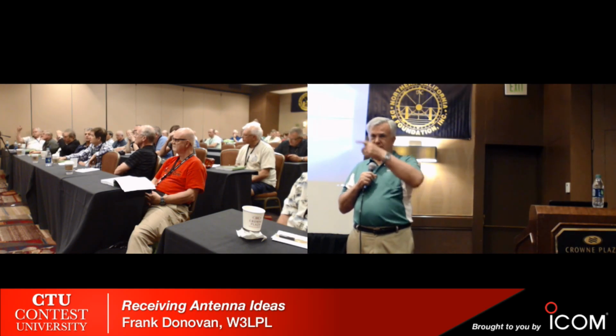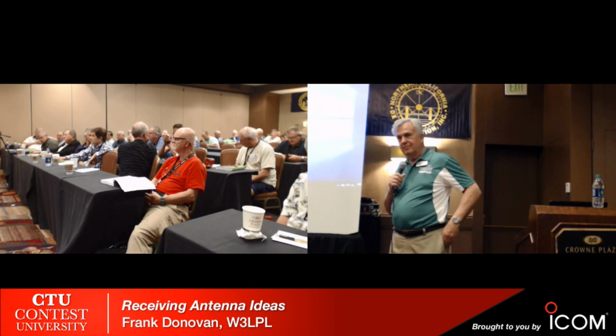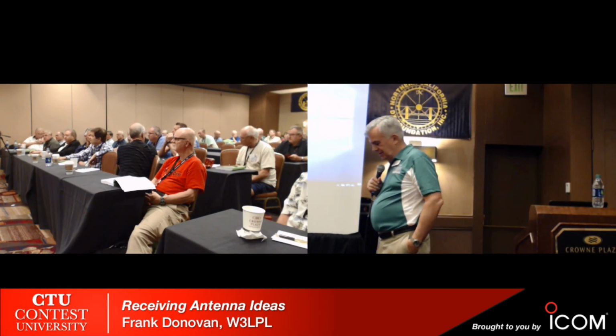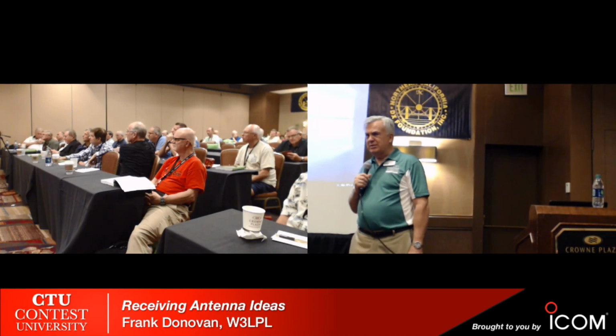This is the last question in the back. I could probably look up the answer, but what's the best radial wire to use for radials? The consideration is almost entirely mechanical. So you don't want to be bothered by broken wires. And broken wires can happen through primarily two ways. One is by human beings or animals tripping over it, and the other is through corrosion from contact with soil.